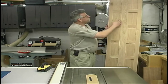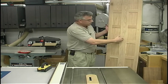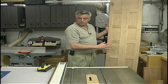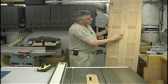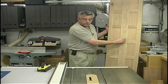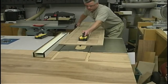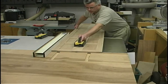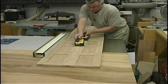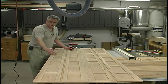To make this a nice strong structure and create an I-beam type shape, we need to interlock all of the pieces together rather than simply rely on glue. We're going to create a series of grooves and dados — the groove will hold the back panel, and the dados will hold the shelves. Once it's all glued and clamped, it'll become a very strong structure. I'll start by cutting a groove down the center stile — quarter-inch deep, three-quarter inches wide, and centrally located left to right — using my three-quarter-inch stack dado head cutter at the table saw.